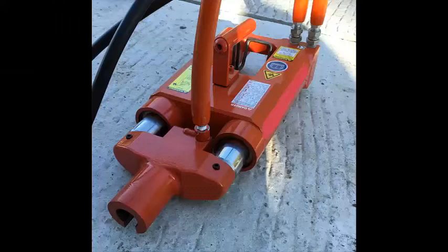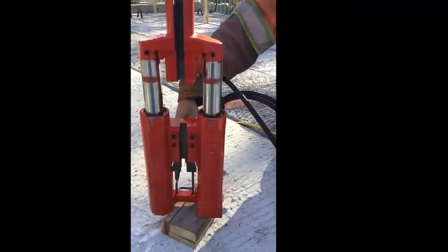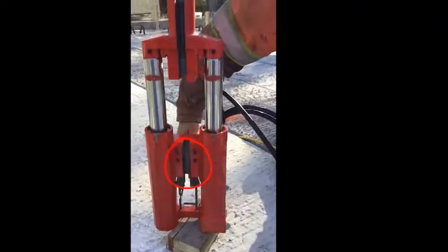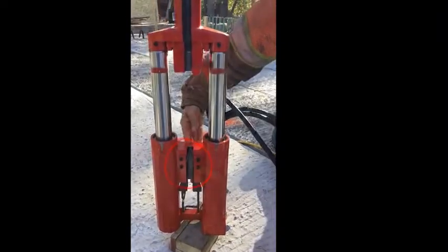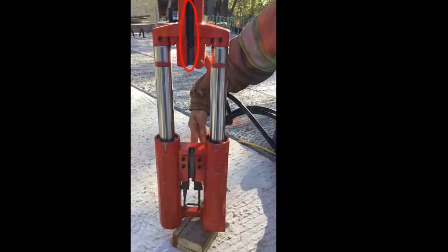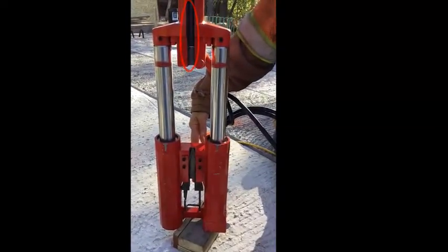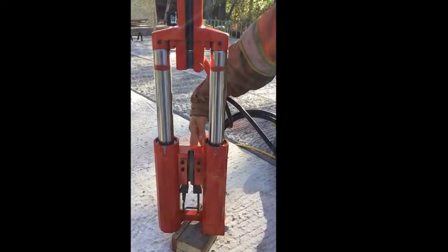This is a typical jack meeting the requirements of the specification. Later we will see how the nose of the jack rests on the collar, allowing the jack to tension along the strand axis. This clip shows the underside of the jack. Notice the puller grips here that grip the strands during tensioning. Also notice the power seater — at the end of the stroke, before the pressure is released, this seats the wedges properly in the collar.